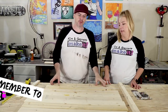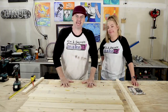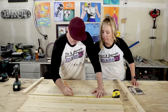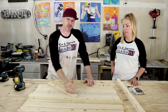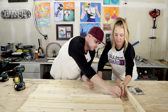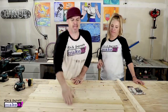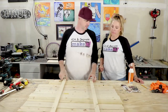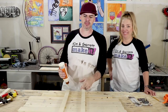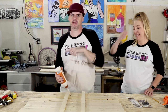First we're going to find the pretty side of each board. We put all of our pretty faces down. Now we're going to find the center of the center board. I'm going to take a little 2-inch screw and pop it through the hole. Now I'm using a flat pencil — I just measured 18 inches down and I'm going to lay the pencil against it. All of our boards fall within the circle. Now we're going to give them some glue, tack them with some tack strips cut to 36 inches long. We'll glue the 36-inch tack pieces, lay those down, put them in with an inch and a quarter brad nail, then flip it over, draw the circle on the outside, and do the cut.